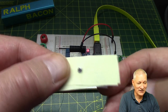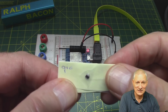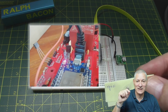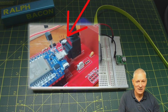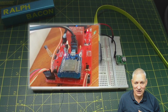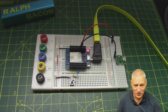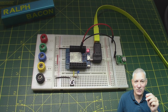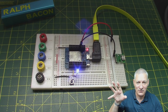Well, I think the clue's in the fact I've had to desolder it, and I'm waiting for some spares to come from RS Components later on today. And as you can see in a little video there, I've had to cobble together a Microchip MCP1700 device at 3.3 volts just to let my smart heater controller continue to work in the meantime, because I don't want to solder up a complete new board. So be very careful with your multimeter probes when you're touching the 3.3 volts on those boards. Whew. Okay, enough of these announcements.